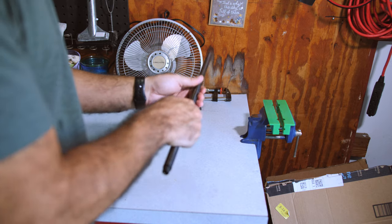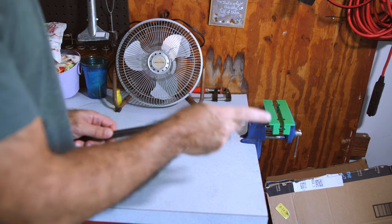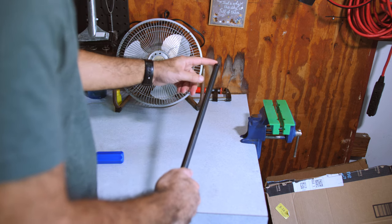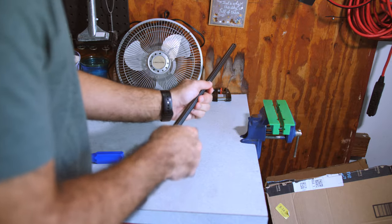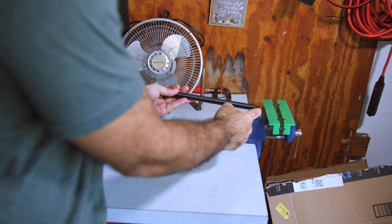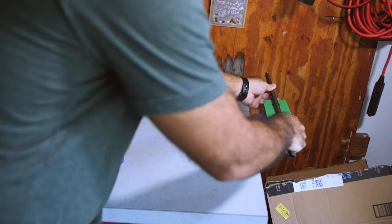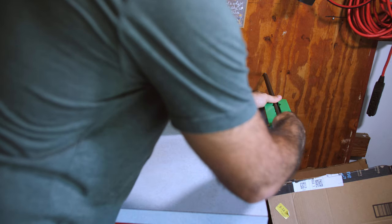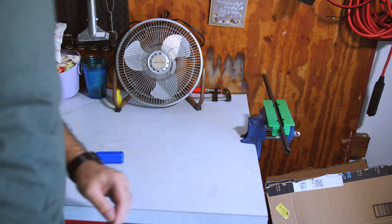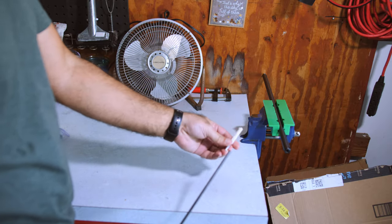After a very good cleaning on the barrel, the next thing is to prepare for polishing. Pay attention to the front of the barrel - this end with the thread is the front. During the polishing process we don't want the mop to exit from the front of the barrel. To prevent that, I have my vise positioned so the very end of the barrel is pointing toward the wall, protecting the crown.